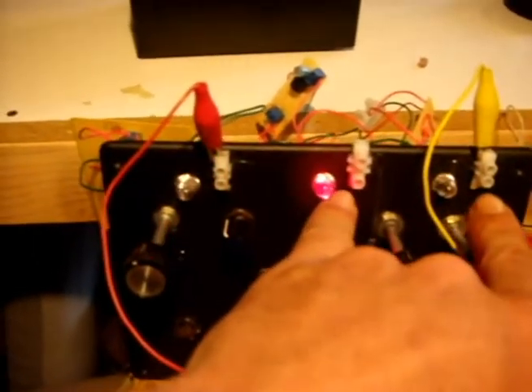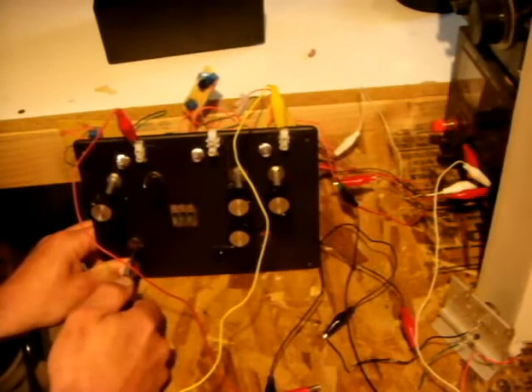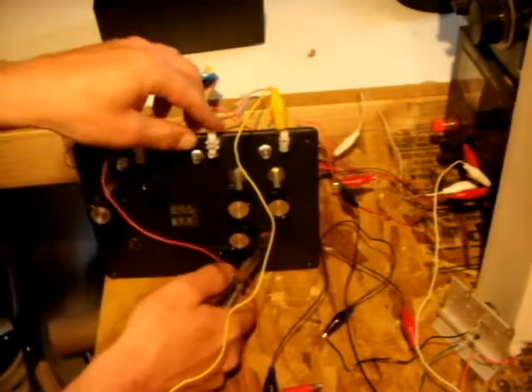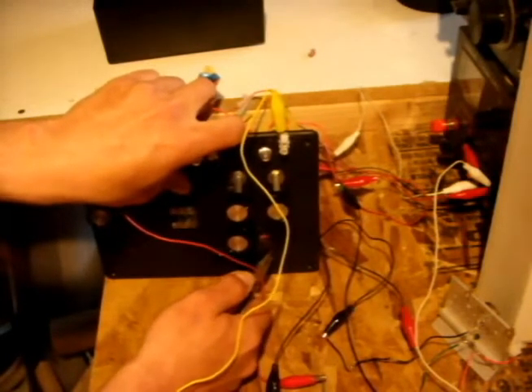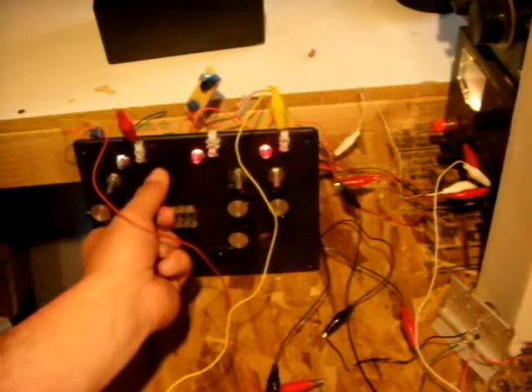I use LEDs as a crude way of showing the on and off time of each output. The vacuum tubes on my oscilloscope exploded during an experiment in which I used the high voltage output from an ignition coil to drive a caduceus coil, so I have no other way to see frequency. The odd part about that experiment was that the scope was not connected to anything and the activity was about 4 feet away. The scope was on, and when I would bring my hand within 1.5 feet from the probe it registered waveforms in the order of a few hundred volts, though I was 2 feet away from the caduceus coil. I heard a pop and a fizz, then saw smoke and lightning coming from the chassis. Times are financially tough, so I cannot afford to purchase a new scope.